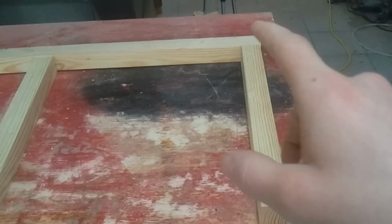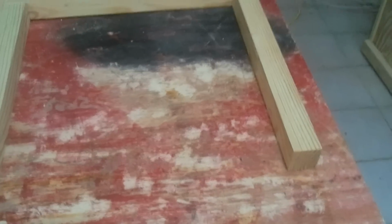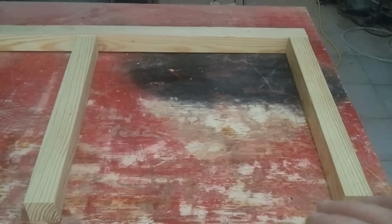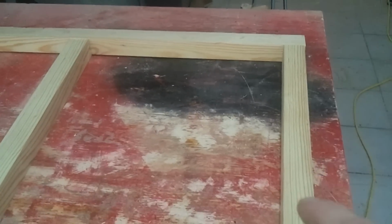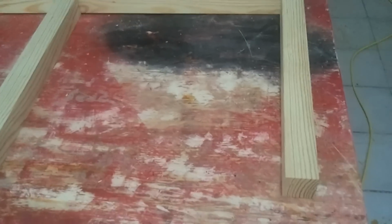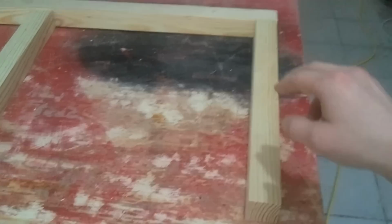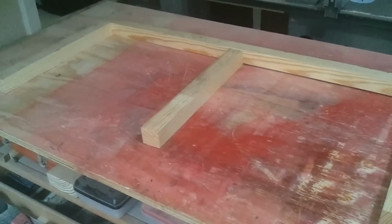2x material into 2x material, it's better to use the 2.5-inch screws, but this is not going to have any type of stress on this whole setup other than wood movement. That's not that big of a deal. And also, I'm going to come back with some molding that's going to tie everything in all the way around. But basically, I'm going to have a piece of 1x down here, so I don't want to use the longer screws. Keeping things simple, 1 1/4 screws, top and bottom, all four of these vertical pieces.